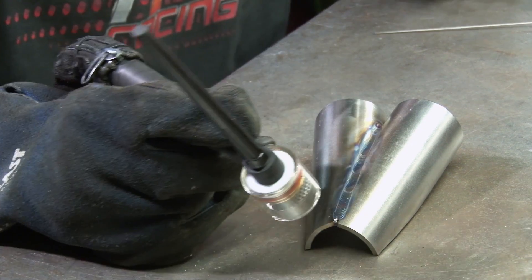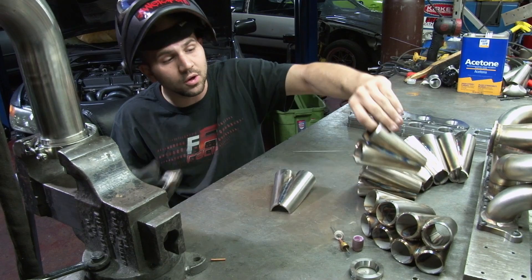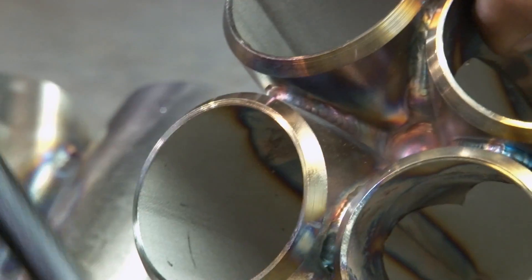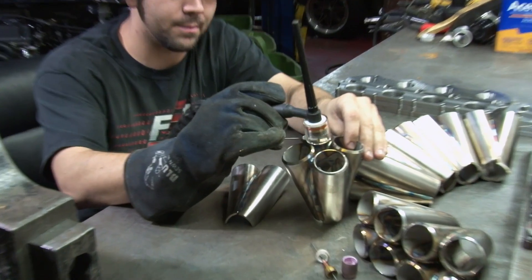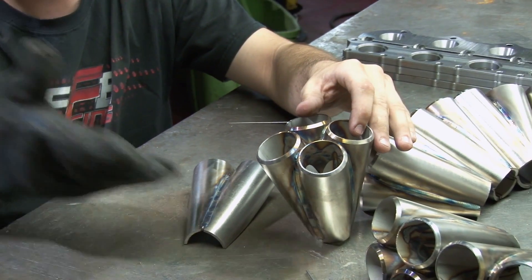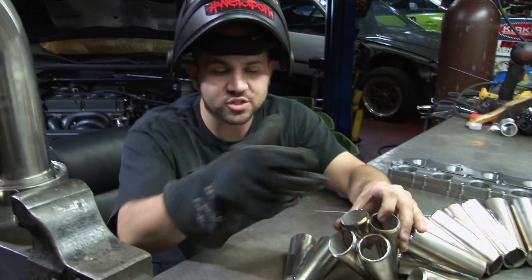I did about four stops throughout the piece, then I make the other half and weld across into the center, which you can see here. You go over the tops and right into the middle to tighten the center. When I get to this point, I have to switch to the other hardware because you physically cannot get this large cup far enough inside to have proper coverage. So I switch to the traditional gas lens for any of the other intricate pieces where there isn't the space, and you'll be able to get right inside to finish off the product.